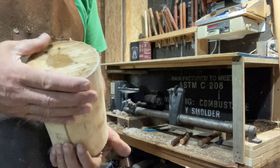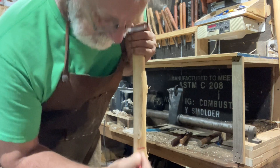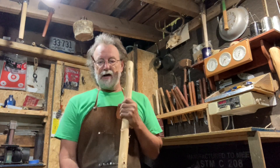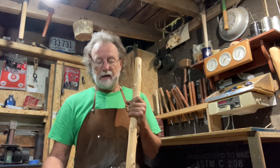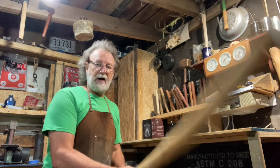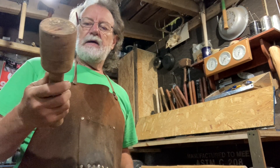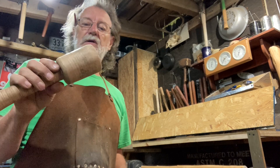Let's whip out a handle for it out of hickory. I measured up a 36-inch handle. When you're splitting rails you don't want to be bending over — you want to be able to stand up straight and hit your glut that's in your log. There were multiple gluts in the log, so you could just stand right up and reach out and hit those gluts. By the way, right there is a dogwood mallet — a hand mallet carver's mallet that I made on video. That's why dogwood, if you can find it, is such a very valuable piece of wood.